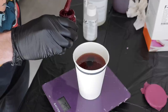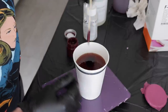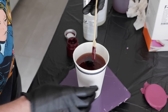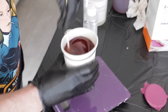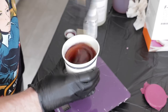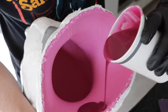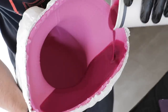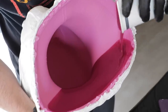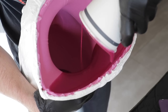Your working time - and it was pretty cold - is about a good eight minutes. That's the good thing about urethane. The only thing is you have to keep it moving in the mold once you pour it all in. I did three total slush coats, a total of 300 grams - Part A was 200 grams, Part B was 100 grams, and then the tints mixed in. You've got about a good eight minutes working time and then it's going to start to kick.